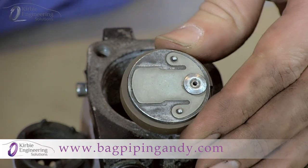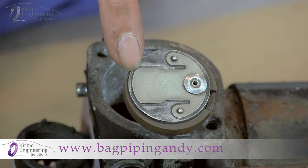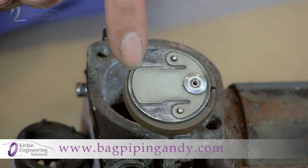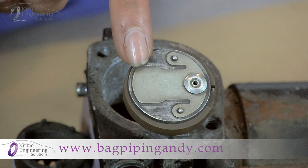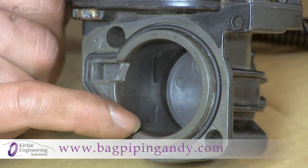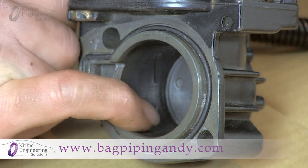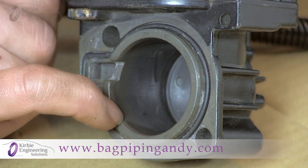This is the piston ring we're going to change. Have a look at the air intake vane on top of the piston — make sure it looks closed. If it's bent open it will reduce performance, so make sure that's closed. The cylinder walls are actually tapered by design — they're tapered halfway up the bore and then go parallel. Check for damage in the cylinder; it should be grey and smooth. If scored or damaged, the new piston ring may not perform well or last very long. Scoring is usually due to the air intake not being filtered, so it draws in dirt and dust which scores the cylinder.